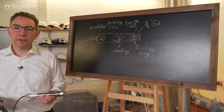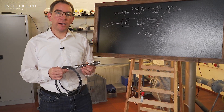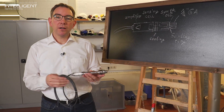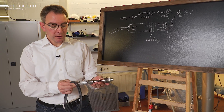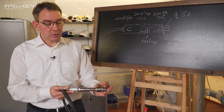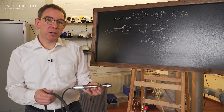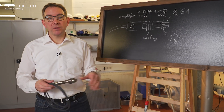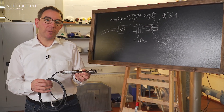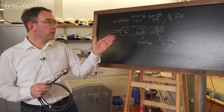The next sensor is the pressure sensor. We are measuring the pressure inside the compression chamber as a dynamic measurement, which is a very fast-changing signal, so we need a fast-responding sensor. This sensor is a special design for a special purpose — in this case with a special tip. The pressure sensors we are using have a very wide pressure range: we can measure from absolute ambient pressure up to a couple of bars, but the maximum for high-pressure applications is up to 6,000 bars. I'm going to explain the principle of the sensor here at the whiteboard.